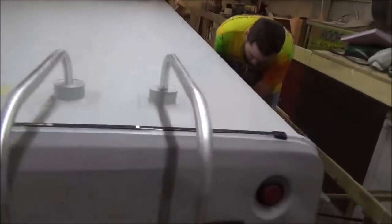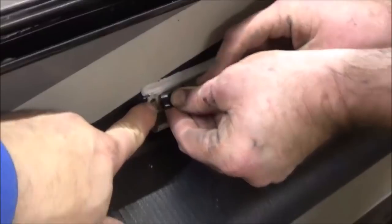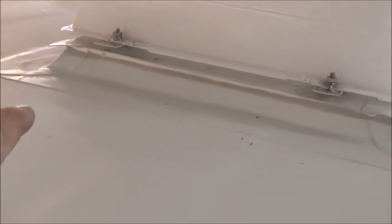What we noticed over here was this screw cap cover was too short, so we're just going to put a new piece in for them. What this is is a 60 mil commercial grade TPO — everything gets all heat welded together, including those boots down there. These are custom curbs we make right here. You can see under the air conditioner — raising it up with some stands just to give it balance. We even got a counter flash on here. This is your curb right there — that's a three-inch weld all the way around. We welded it so you don't have caulking there — it's welded, you don't need any caulking on that.